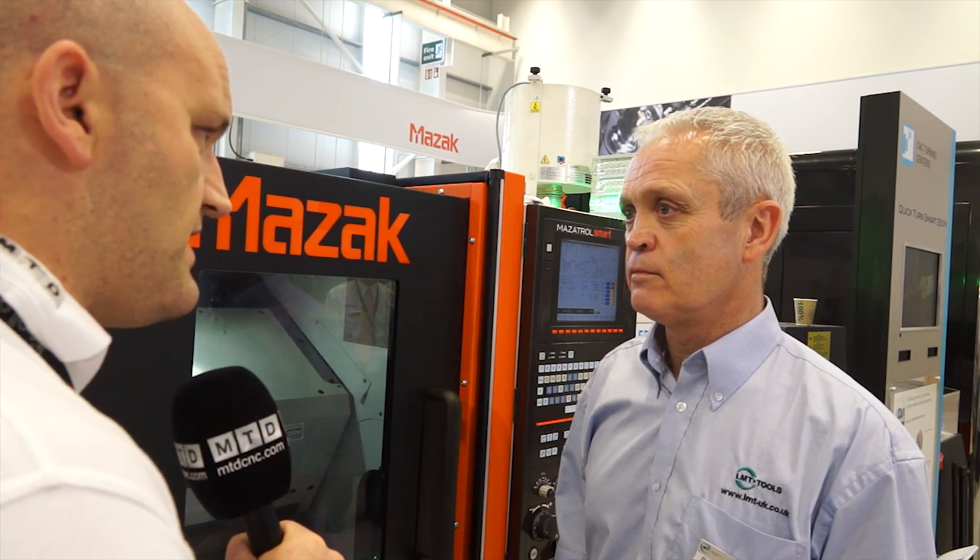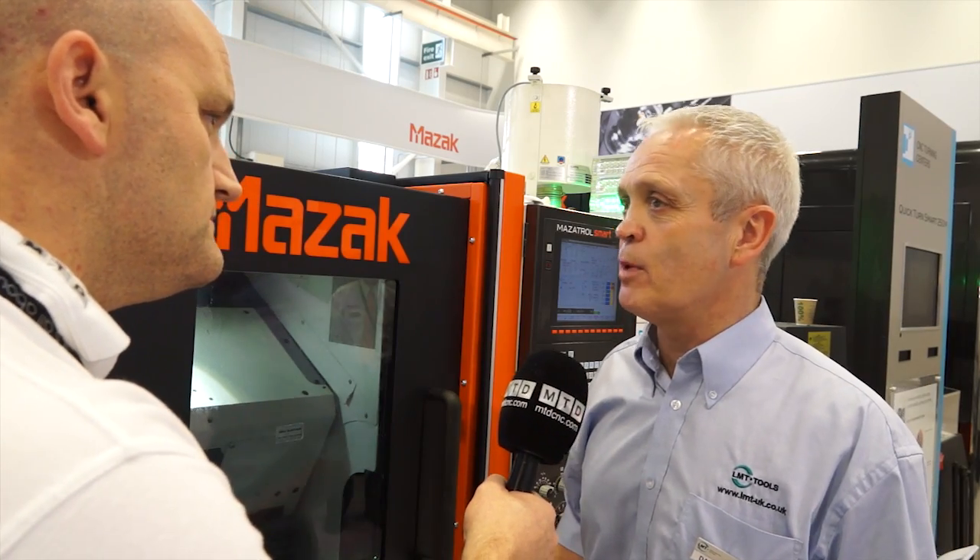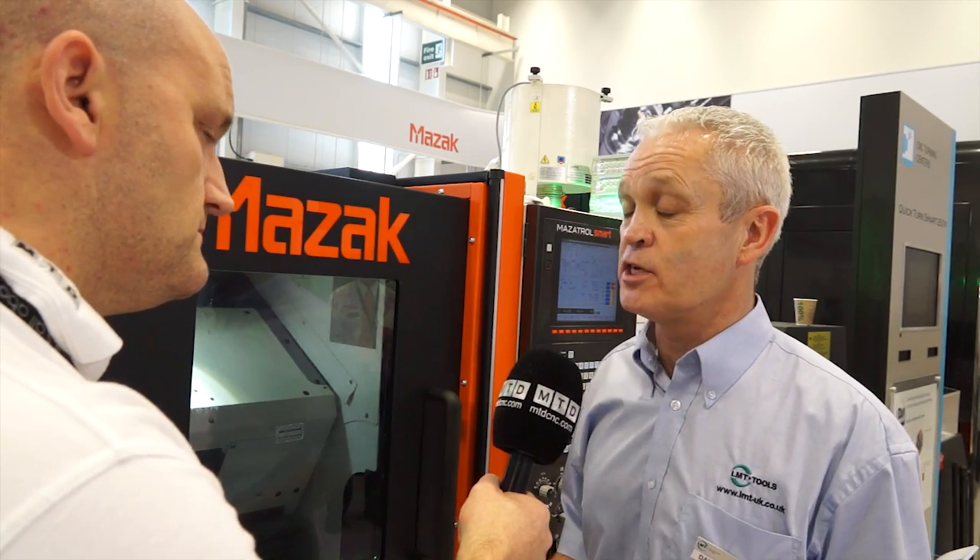And this is only EN8. Presumably, the saving's equally as big on heat-resistant alloys or stainless steels. It certainly is. Obviously, on those sort of materials, you may have to have 10, 11, 12 passes and it will still only be one pass with the rolling head.